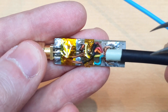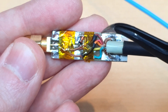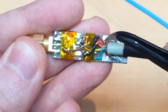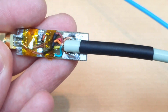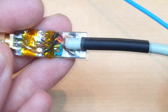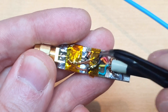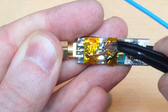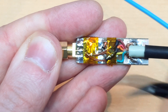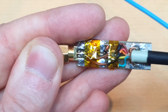So if the voltage between the two grounds tries to increase above the drop of the diodes, they hard-conduct, shorting the two grounds together. I think this is the final solution guys. You can see the construction here. These cables here are very bad to solder because they are PVC and they melt down. So if you are able to get a silicone cable, that's probably much better to work with here. But soldering with low temperature, you can make the solders here. Using very thin connections to the resistor and to the temperature diode, we reduce the energy consumption of the heater, preventing thermal energy dissipation.